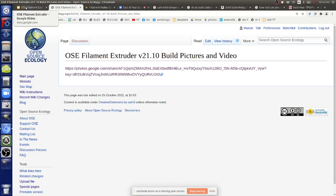It would be really interesting to have those curves, but to incorporate that into the RepRap as an algorithm-based solution, or to deal with the hysteresis, the overshooting and undershooting, and even that out through the RepRap, I don't understand how we can do it, because that's G-code, Marlin firmware. Within the temperature control algorithms in Configuration.h, you can actually set some of the parameters for how the temperature gets measured. Yeah, that's part of the firmware, not the G-code, so we can use feedback loops just relying on the Marlin firmware, right? Yeah. So if you can find a way to capture the data with the Marlin firmware still on it, that's probably better. Then we assign the thermometer as if it's the bed heater, and make that reading turn the heating elements on and off. That's what we would like to do.